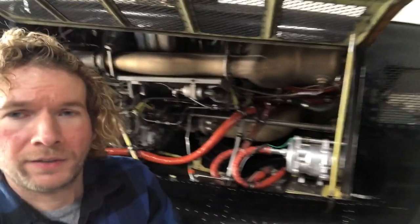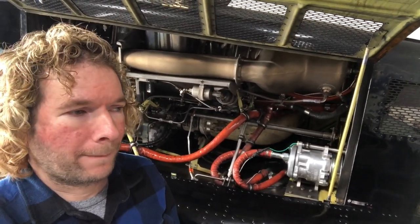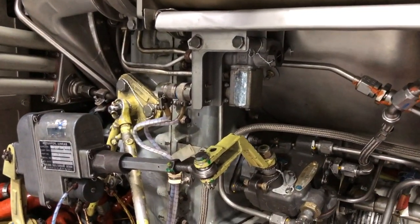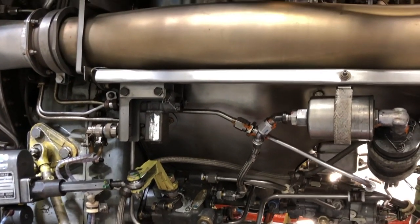It's very important to maintain the RPM of the power turbine because it sets the RPM of the rotor blades indirectly. To do that, we use a power turbine governor, which spins and monitors the power turbine RPM, then communicates with the fuel control through hard pressure lines — essentially talking to each other. The governor says it needs more or less fuel, and the fuel control unit responds. For younger folks, we typically think of signals sent by electricity, but voltage is just electrical pressure — so a signal sent by air pressure isn't conceptually all that different.